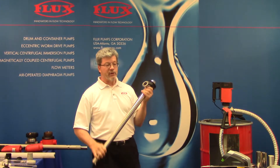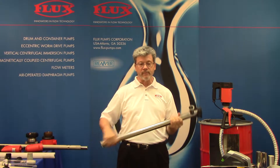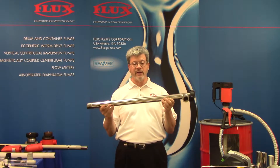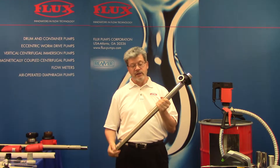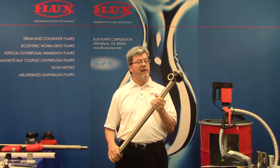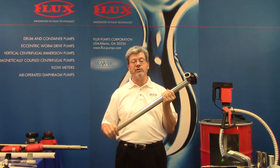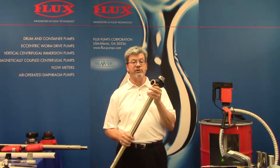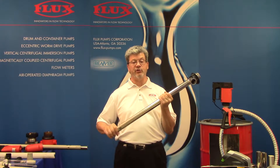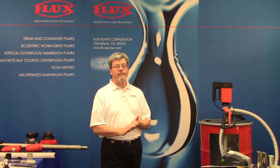The fifth model is the 427 — a sanitary pump with a 1.5-inch tri-clamp discharge port. This comes in a 3A version — the dairy standard concerned with bacteria. The entire pump is submitted to 3A for approval, electropolished to 30RA and hand polished to 4RA. We also have a non-3A version electropolished to 30RA but not hand polished, saving about $300 over the 3A version. We have two different price points for a true sanitary impeller pump. That covers the five materials and five different designs.